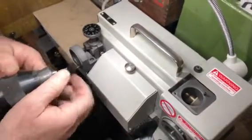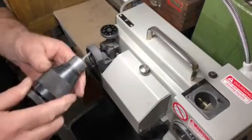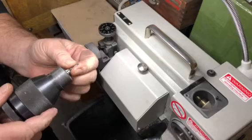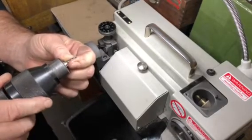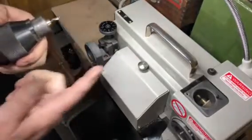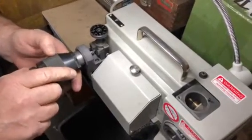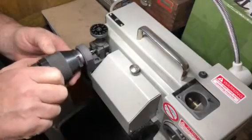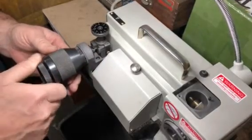To time a short drill, you put it in the chuck. This is a precision 4-jaw chuck, and you leave a little bit sticking out. The jaw will tighten down very accurately, so it's just a little bit loose. Leave it long and the drill a little bit advanced, then slide the drill into the timing shelf. Hook it under the lip how you normally time a drill, and just rotate the drill like so, and tighten the chuck.